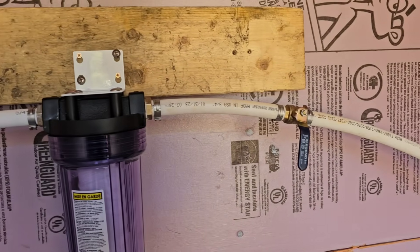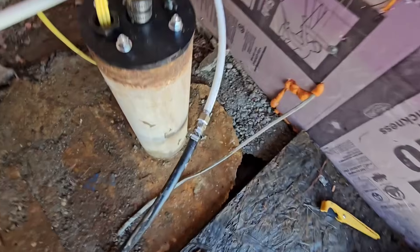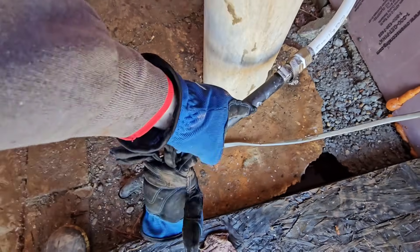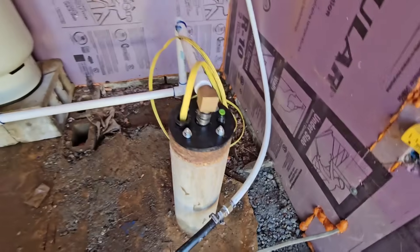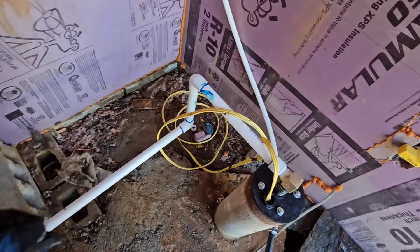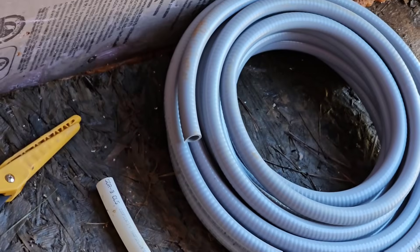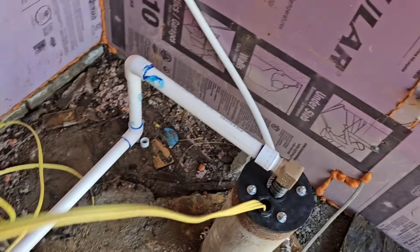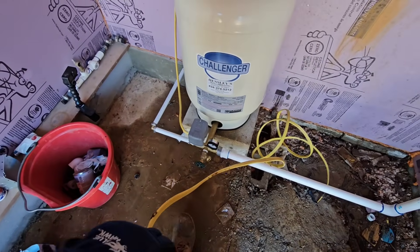The filter is basically completely done. I had to use coil pex because that was all I had left on the truck. I went ahead and made my conversion over right here, heated the pipe up to give it that nice little curve and bend, and it's all done. Last thing is I've got to strip out the wire, cut it to the proper length, and get my flex conduit over there. Then we'll put this wire through the conduit, run it into the switch, and it will be time to turn the system on.